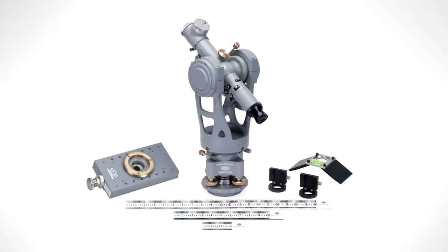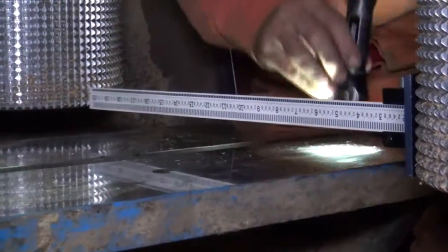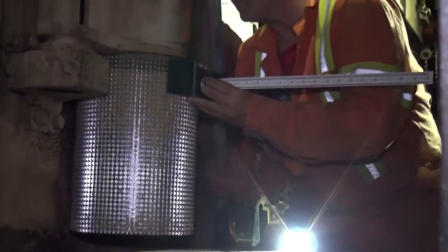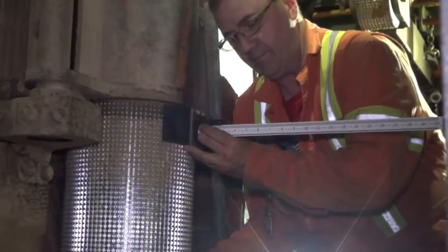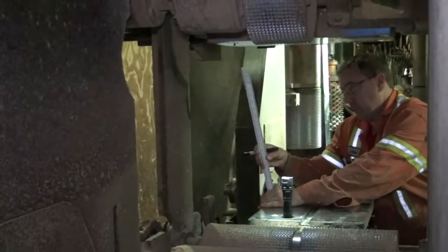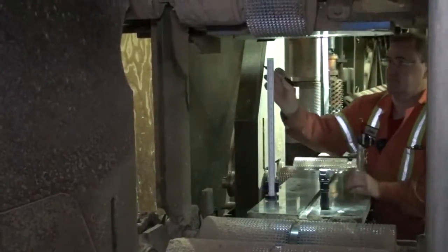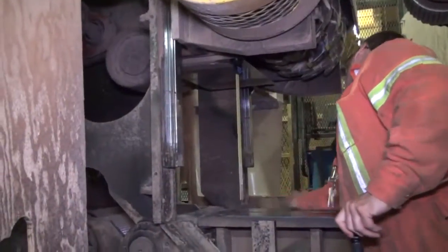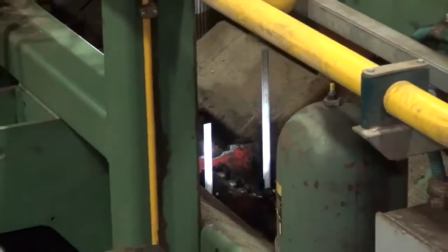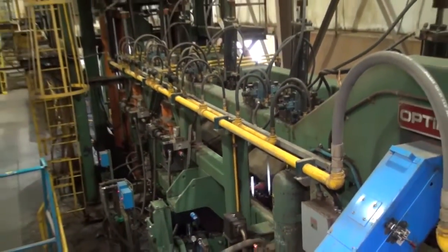Several accessories are included in the sawmill kit to aid the measurement process. The 567 V-Block works to secure a precision scale to various types of rollers — here we see it securing a 20-inch scale against a feed roller, measuring rollers on both sides of the machine centerline. The 567 V-Block includes the removable 567-A magnetic scale holder, which locks a scale into place and provides hands-free tooling to measure any flat surface in the mill, including the lower anvil, top anvil, both side anvils, and the lower pan on the double length infeed.